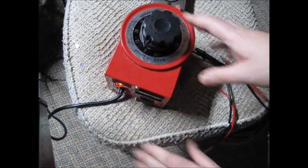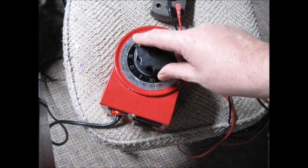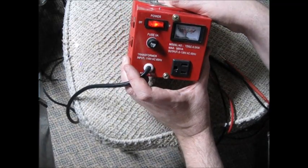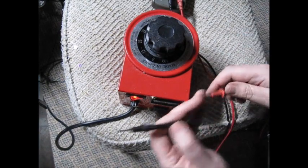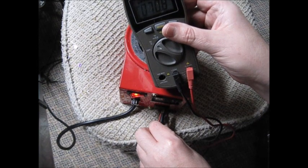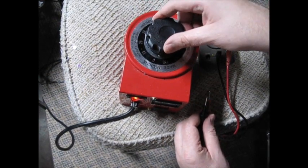The built-in meter reads maybe about 50-something — maybe about right. But what does our external voltmeter say? 70.8 volts. Well, that's only 5 volts off, not too bad. Let's go up to 100 on the dial. The external meter reads 104, 105 — and what I think should be about 110 for a vintage amp reads 130 volts on the external meter. So if I set this to 117 thinking that's normal house power, I'm actually getting 135 volts.